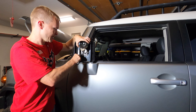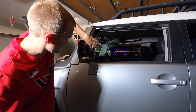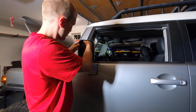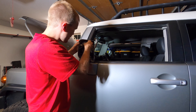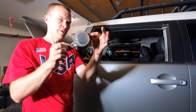Next, we've got this little tab right here — we'll push in on that and then just pull out on the black housing. Pull this off and set it aside. Next, you'll see we've got a screw right in here that we're going to remove, and then we're going to remove this one as well. Go ahead and remove our light bulb as well, and then remove our whole housing with the old fixture.